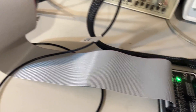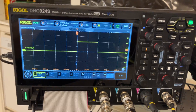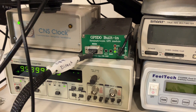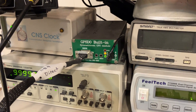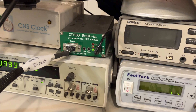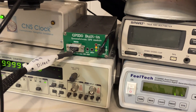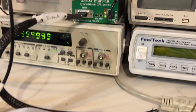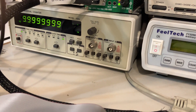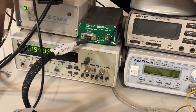This uses a low-cost flat cable — the same kind used in older computer disk drives. The signal is coming from two GPS units: one is the older American CNS one, and I also have a Chinese time base for the old analog cell tower which has a 10 megahertz output stabilized with a GPS. This is useful for my frequency counter — a low-cost one but it works very well with GPS timing compared to an HP frequency counter that costs a lot more.